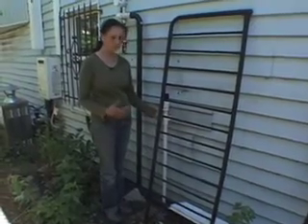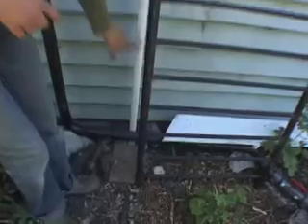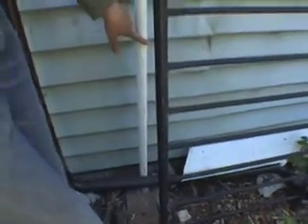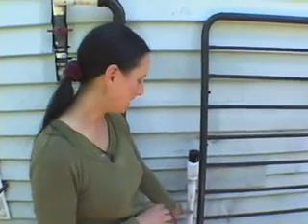It comes out of the house — you have to drill a small hole, though you do have the option to go out a window. This is called an auto vent and it creates an air gap, so if there's air in the system it vents the system. This is one inch pipe, and the one inch size is really important for the washer system because this is a pressurized system. We want to keep the pressure of the pump, but we don't want to add a lot of extra stress on the pump — so one inch is the ideal size.